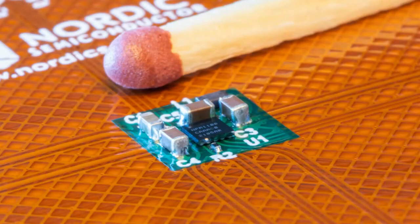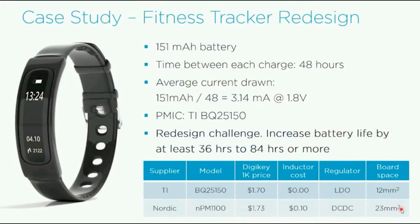It's really small — all in one. So instead of having two or three chips, you have one. The solution uses some capacitors and a couple of 0402 resistors to set the charge current; most of the pins are just strapped. There's also an inductor for the buck converter. They did a case study in the presentation showing that while going with a buck converter is bigger and more expensive on its own, because they combo it with your LiPo charger you kind of get a two-for-one — it's the same price as just having one or the other.